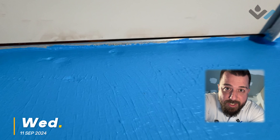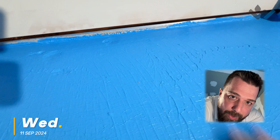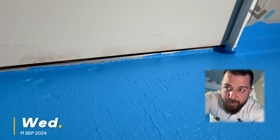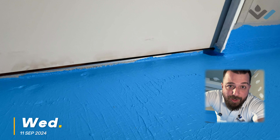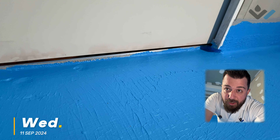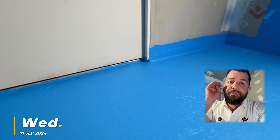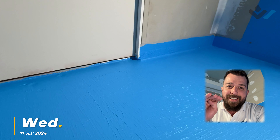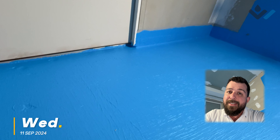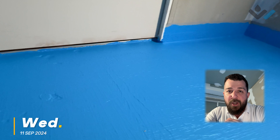What we'd expect to see is that water stop angle to be almost covered with our upturn of our blue waterproofing membrane being our primary, and we would also want to see a healthy corner fillet there just to allow movement accommodation between those two substrates. So a little bit disappointing that the rest of it was done so well around the perimeter and then this was just missed. I understand there's a little bit of a risk with the tiles - you need to be able to butt your tile right into that water stop - but you can still put something in there and get a nice curved radius. Probably a little bit of a touch-up needed there.